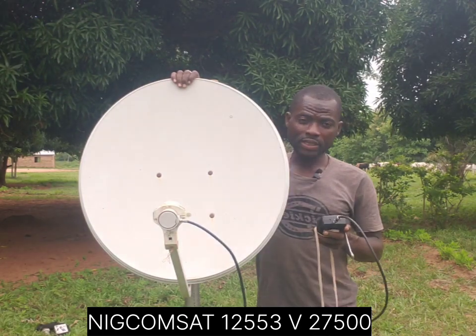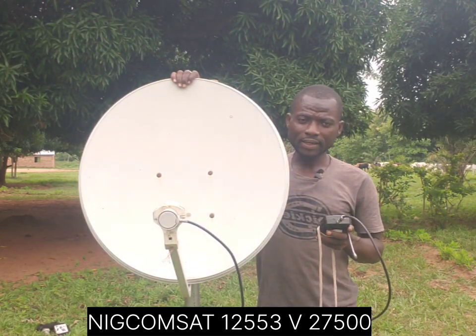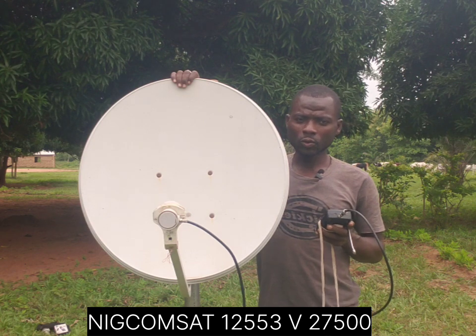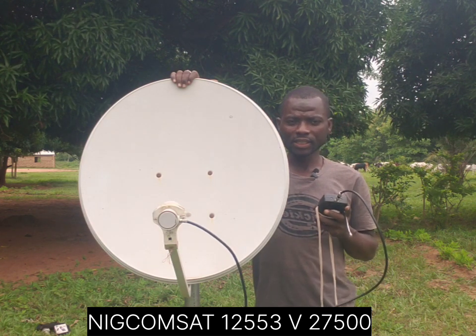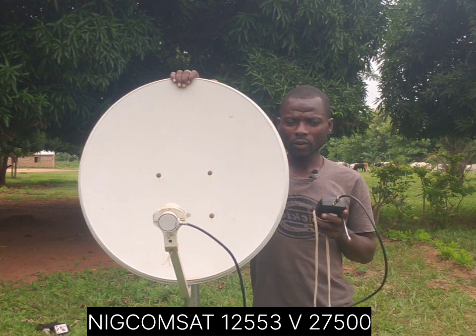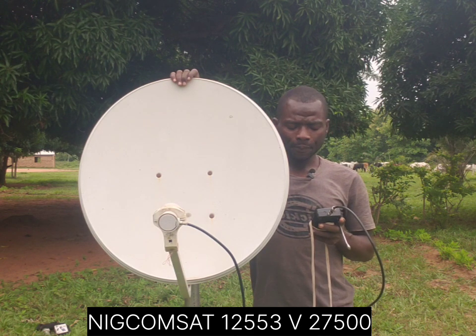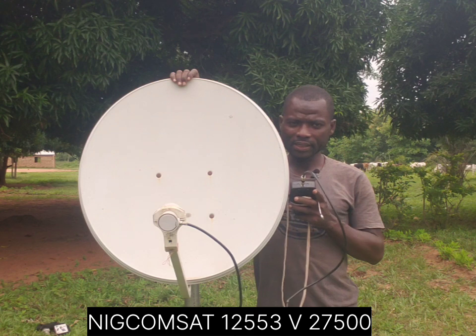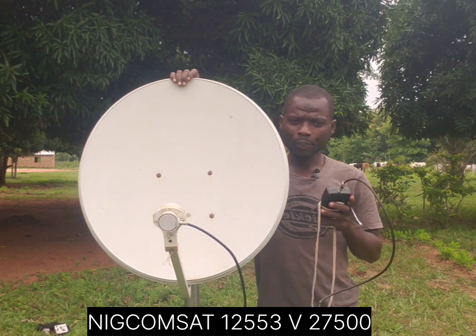It's very simple — first track for your MultiTV, when you're done send the dish towards your left a small amount and then you are good to go. Whether you're standing in front or behind the dish, the dish goes towards your left. Now let's see the maximum signal this 60 centimeter dish is going to give me.